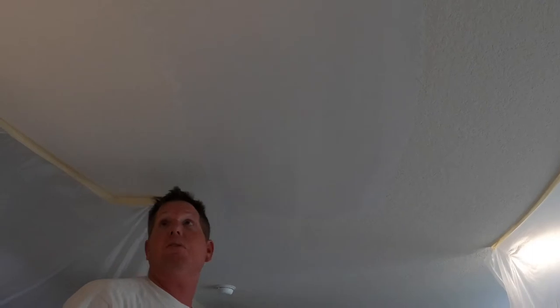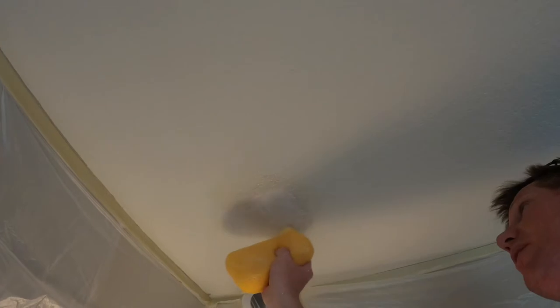So any heavy edges you want to fix, pitholes - now we've got a nice, even, flat surface. This texture is really, really heavy, so when we spray it, it's going to cover. There's one little spot over here I neglected to get - but another good thing with plaster is it's workable, so we'll fix that up. Then what I like to do is sponge the edges. This is just a damp car wash sponge - we'll knock those edges down a little bit. It helps with our blend. For a lighter texture you can probably get away with not doing this, but this is a safeguard. Just come all the way around with that sponge, stay out of your middle, just sponge that edge.